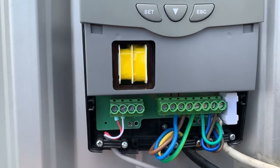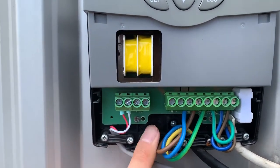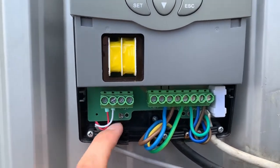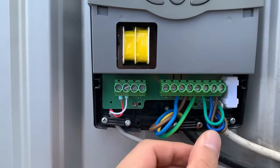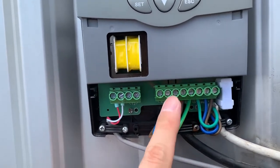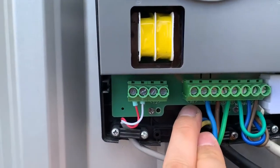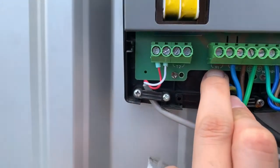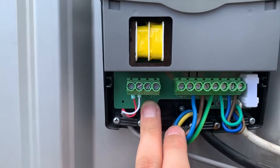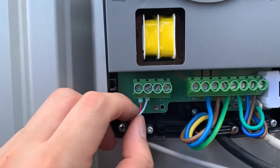This controls which time you want the heating element to begin working. To summarize the terminals: the main power goes to the heating element and delivers electricity to it. R1 is for the pump power. T2 detects the temperature of the hot water return pipe. T1 detects the temperature in the solar tank.